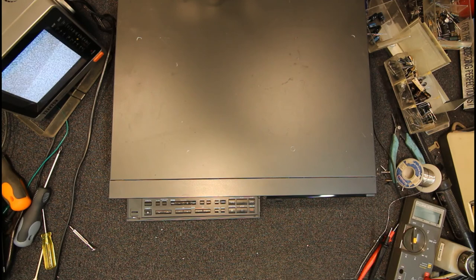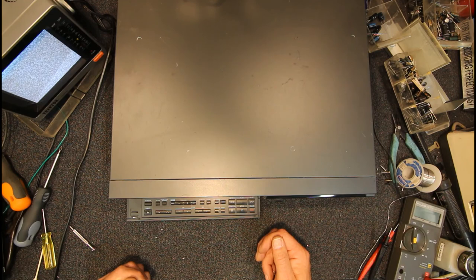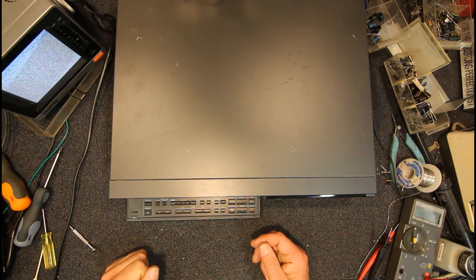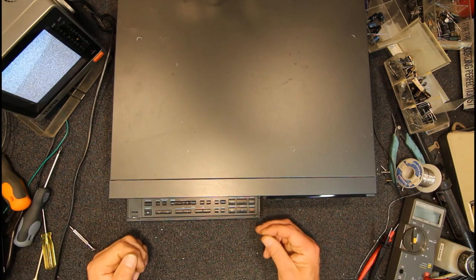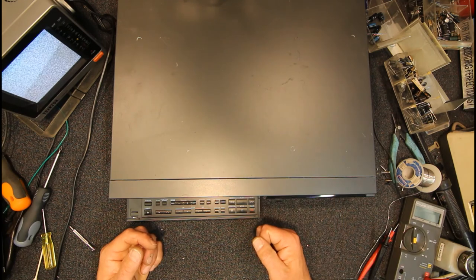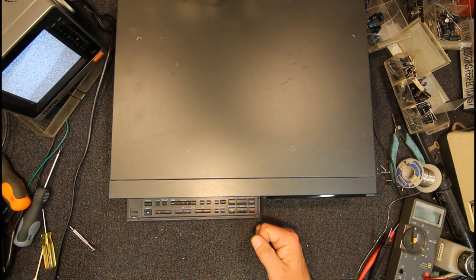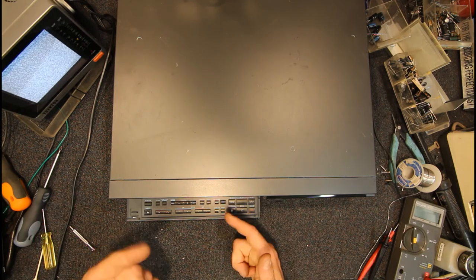They're not too bad to work on, but it's mainly about winding it through by hand. And there are manuals that show you how to line all the gears up from memory. Like I said, it's when the deck's loaded in, into that first click position and the arm's out, that's where you set everything up. And they're not too bad to do. As long as you just check, if you get one that's out of whack, just check every gear. That's why you wind it through by hand.